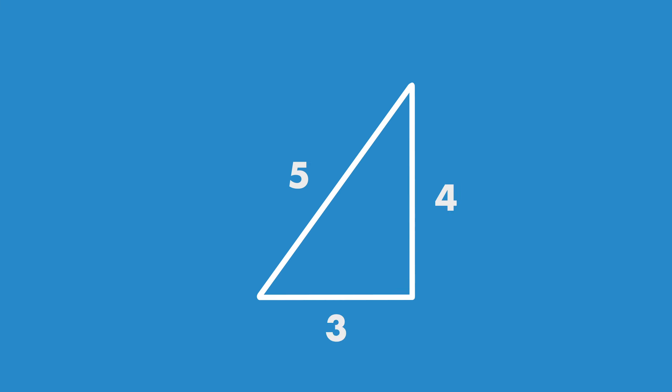So you take another panel and divide it in half. Half of an 18-inch panel gives you 9 inches. Add that to the two-and-a-half inches and you come up with a starting panel of 11 and a half inches. So we've figured out our panel layouts and know we have an 11.5-inch panel at the beginning and end of our roof run. How do we make sure that first panel is square when we install it?